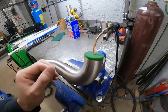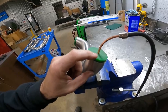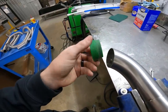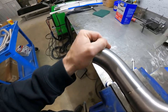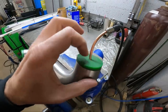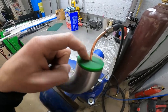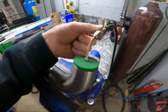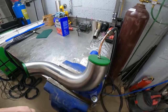He's actually got a lot more fancy versions now. These are the original versions and they've been well used. You can see where I burnt them a little bit, getting really close, but I usually just use two of them, one for the vent and then one for the argon going in. It's just a copper tube. It's got a flare on the end, something I'm cramming the hole, and we also got some other stuff that you screw this fitting on. So it's kind of my universal tip there.